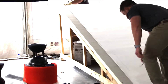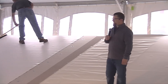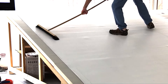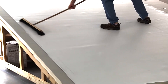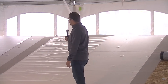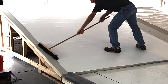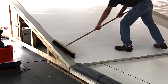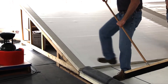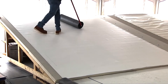This system does have a full FM 1-90 rating — 90 pressure in the field, 150 in the perimeter, and 225 pressure in the corner. We're currently capping the system at a 20-year and 90-mile-per-hour wind speed warranty as well. It does look a little different than our standard fleece-back membranes. The nice part with this is it's always going to be the same type of system — consistently repeatable, with no flash-off times or coverage rate issues with any type of adhesive being dispensed.